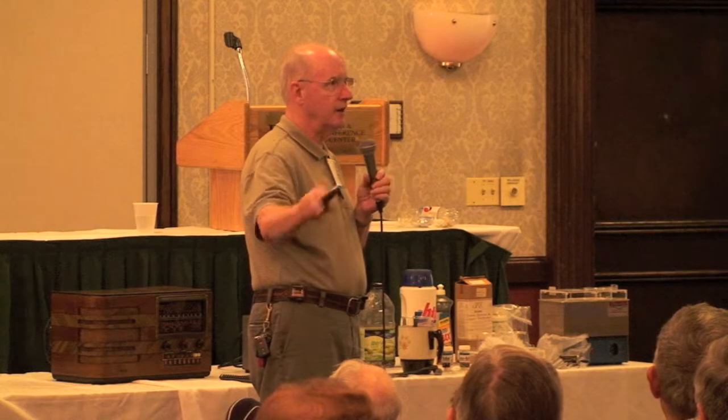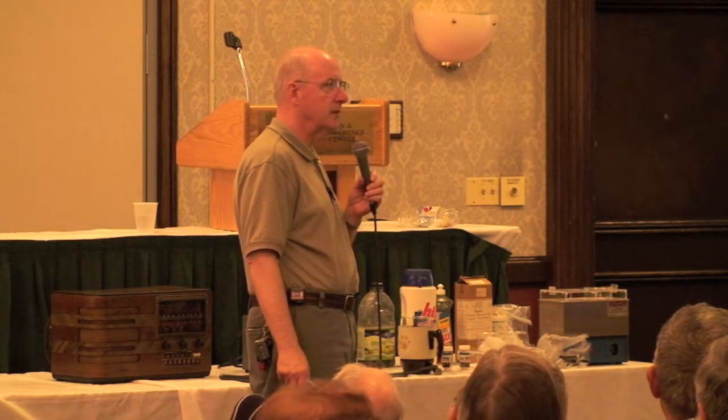What about this plain old aluminum chassis? Wash them down with sodium bisulfate, but be sure to rinse them and force dry them immediately, or you'll see a sort of yellowish brown streaking on the aluminum. But you can do a very nice job of cleaning aluminum.